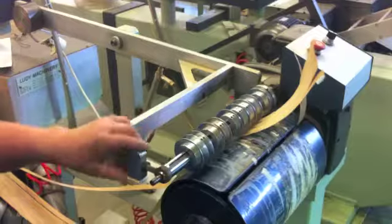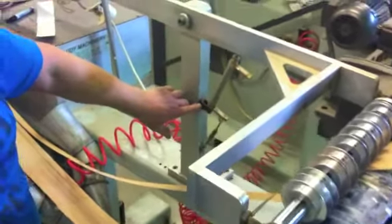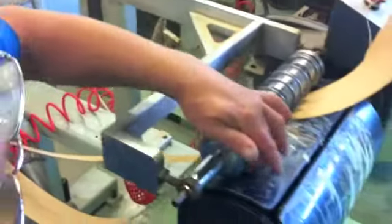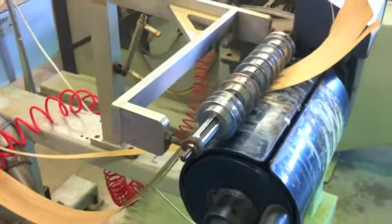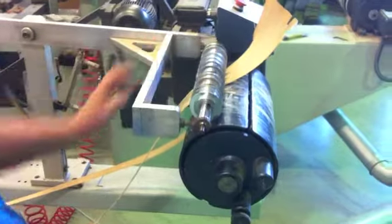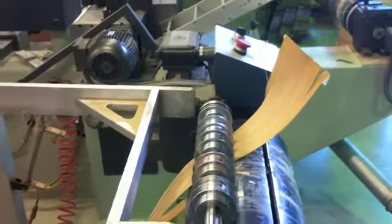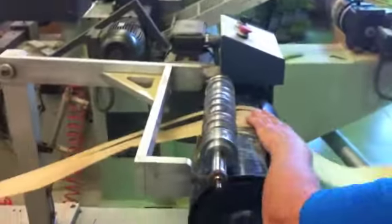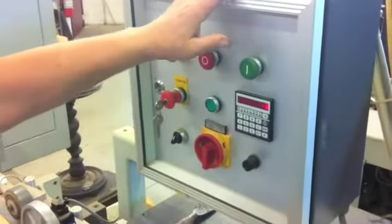This height is adjusted in your machine for a diameter of 200 mm. It's possible that you must drill the hole from that cylinder a little bit lower. It must be before the center — always before the center — and be sure that it is in line with your shaft. If you have clamped the veneer and everything is adjusted, first you must check after the saws, and then check after the disc from the winding system. The first time you push start, you pull the veneer till here. You can stop it here — this is the same stop as there. When the veneer is clamped and everything is adjusted, push on this side and the winder will start to work.